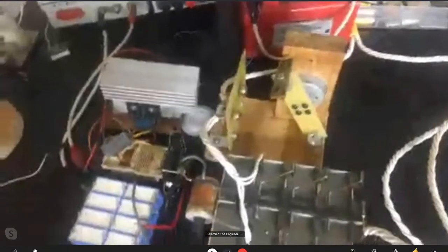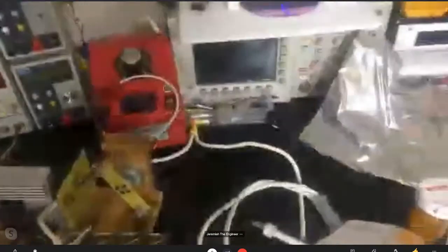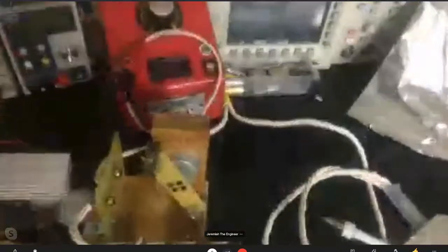But yeah, that's the basis. It's not a complicated thing, but I'm gonna replace this whole entire circuit here with an SCR, and I'm gonna drop the voltage down on this and increase the current, and we can deal with some of these inductance issues. Charging-wise, it's really efficient, but in terms of repeatability, I do not like something that sounds like this. That's pretty terrible, even though it works really well. So we gotta replace that with solid-state components for sure. But at least we have pulse power now. We have pulse power at 7 kV and a decent amount of current, too. Enough to apparently make sparks fly off of a piece of aluminum foil with no holes in it.